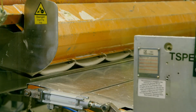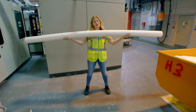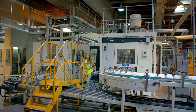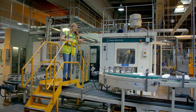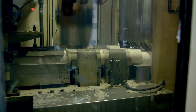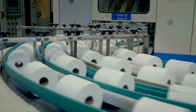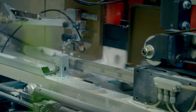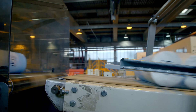Here one comes — and this is what the roll looks like now. This is far too long — it's not going to fit in anyone's bathroom! So the long rolls are brought to this machine called the log saw, and inside there's a blade that will cut the toilet roll to the right size. The blade spins around very fast, cutting four toilet rolls at the same time. Just look at how many toilet rolls there are — all of this is on its way to packing. And here we have a finished pack of toilet roll, ready to be sent to the shops for us to buy and use.